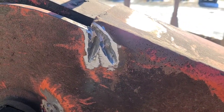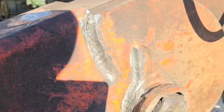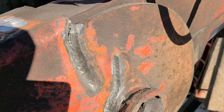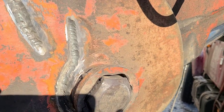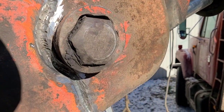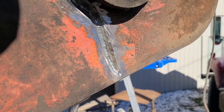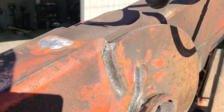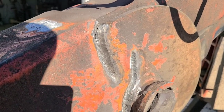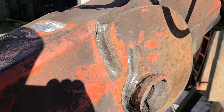This is the side with a little less cracking. Carbon arc gouge — I was on about 260 amps, 5/16" carbon rod, and 80 psi air. This is about a half-inch plate; I was trying to dig in about three-eighths, so we've left a little crack here to burn rod on. Let's do that.